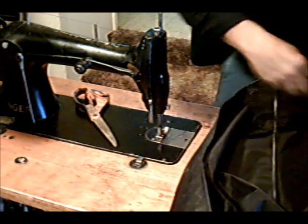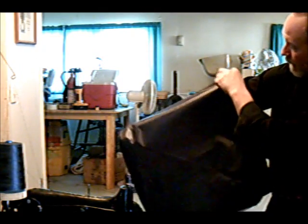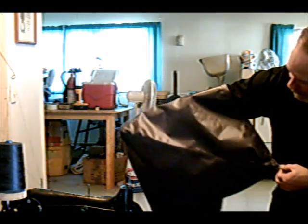This is now a complete hovercraft finger. This has been completely done — you can see the shape now that I've moved the camera back. This part here being the tab that you attach to the top of the hull, this is the outer edge, this is the bottom where it touches the ground, and this is what attaches to the bottom of your hull. That's a complete finger right there. These right here are loops — these are for zip-tying the bottoms of your fingers. There's one right there, it's zip-tied in.